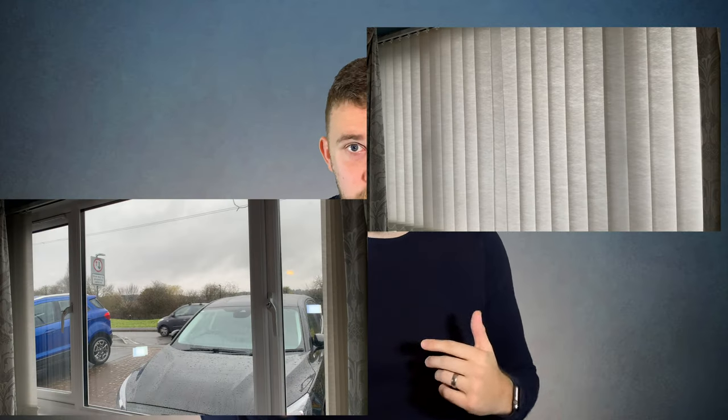The last thing you need to do is set the open and close levels for your particular blinds. It's not going to know by itself — it needs to know when it's pulling to a certain level is open and when it's pulling to a certain level is closed. You just do that by moving it to where you want it, pressing the set button, and then storing it with the up button.